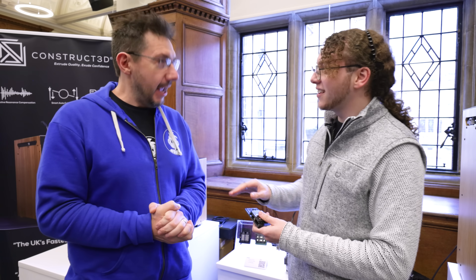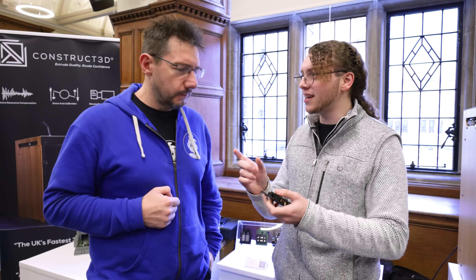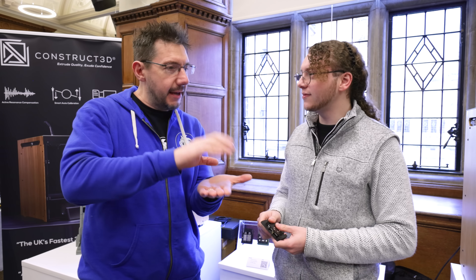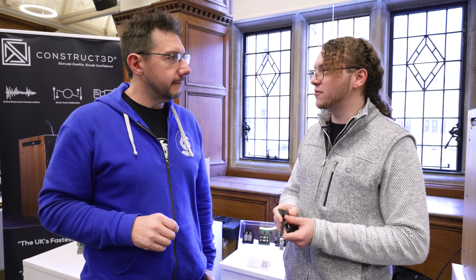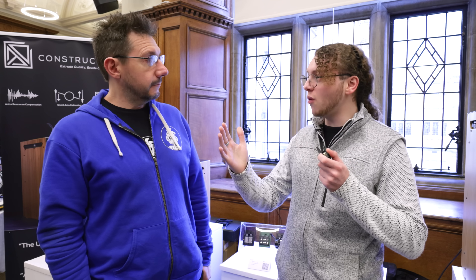Vorons — hot topic. And I noticed a problem really early on with the new TAP plates that keep coming out. So up to now, TAP plates, there's a little bit of a rock because they're using a single linear rail to go up and down. TAP is when it uses the nozzle to hit the bed and then the head goes up just a little bit — it's a button and then it says you've hit something. A lot of those probes kind of wobble just a little bit because it's on a linear rail and you need to pre-tension that rail. It's not perfect. Solution: double the rails up. You get a lot more space. You don't get that wobble anymore. You can push those high speeds that Voron are completely capable of with no worry about the rigidity of the bracket.